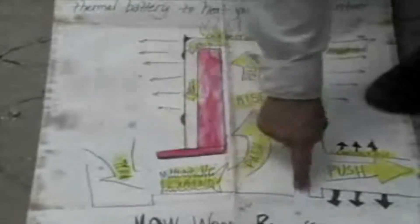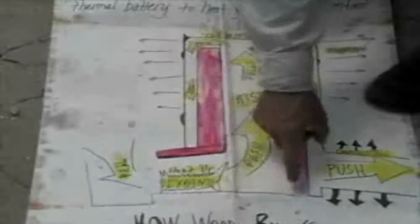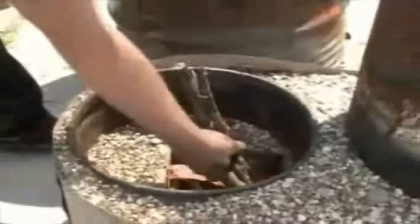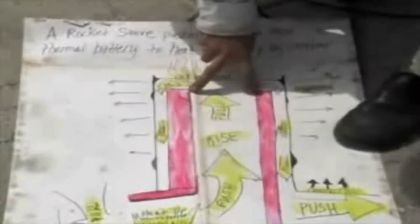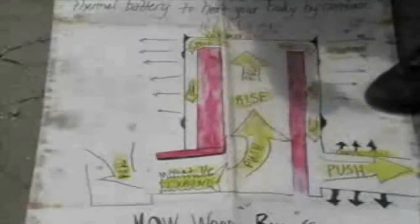The reason that there's a sharp corner here is so that the exhaust gases which will be streaming off the logs that you've stuck into the feed tube will suddenly be tumbled together. Then this insulated heat riser — that's what we use the vermiculite for and that's why we use triple wall pipe — is to keep that turbulence and that temperature at a high level.